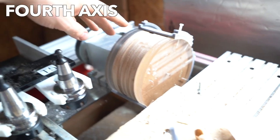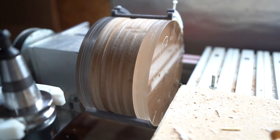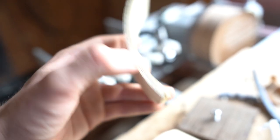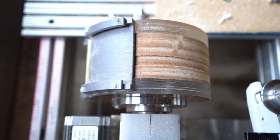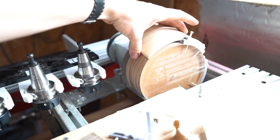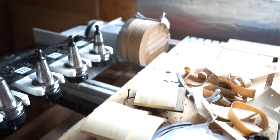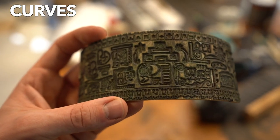We're doing a lot of testing and design work, and some rework — doing a lot of 3D printing. I got the fourth axis set up and ready to run. I 3D printed some collets to hold down the curved parts. We make these ourselves. This is veneer that we clamp up on a form, and then we'll put it right on here and carve over top with the machine as this fourth axis is spinning. As this turns, the spindle goes over top with the carving tool and carves into the wood side that is clamped on here.